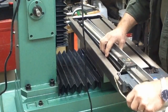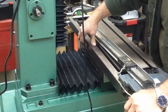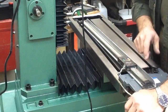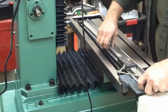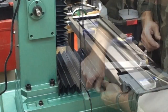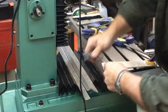And it's not a difficult mounting system. Like I say, I'll mount the aluminum angle itself, and it's just a matter of laying it out, drilling, tapping two holes. Now I'm going to have to drill another hole and figure out positioning on the aluminum angle here. But other than that, everything will bolt right up, and then I'll go ahead and build the bracket and drill and tap it into the Y-axis casting. Castings drilled pretty easy. They seem to be pretty consistent and seem to be a pretty good casting.